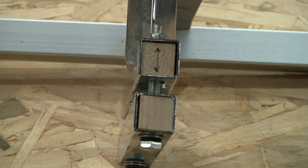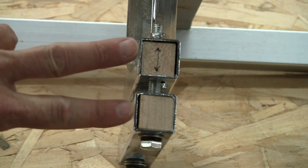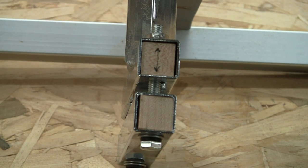To prevent these square tubes from deforming under pressure, I inserted some small blocks here. Just measure the size of the tubing and cut the pieces from some scrap wood. For best results, orient the grain vertically, then drill an oversized hole for the bolt. I'm not sure that the grain thing matters, but that's what I did.